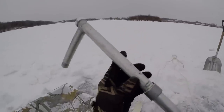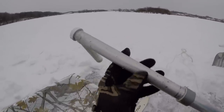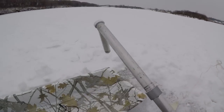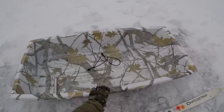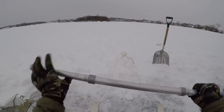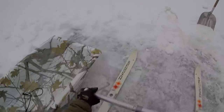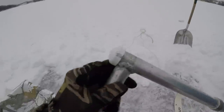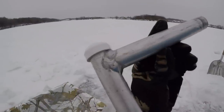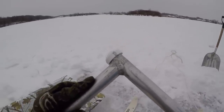For the aluminum legs I used one inch outer diameter aluminum tubes — you can get these in various wall thicknesses. I used eighth inch thick walls. I considered using sixteenth inch thick walls, but I cram probably 100 to 120 pounds of gear into my sled, so I figured I better go with the eighth inch for a little more strength. I've had this setup for three or four years now and never had it fail on me, even pulling it over some pretty nasty snow drifts. I had to have these welded at a shop — if you don't have a welder or don't know somebody who'll do it for free, it pays to call around. One shop quoted me at 55 bucks for a one hour minimum; another quoted me at 20, so that's where I ended up taking these.